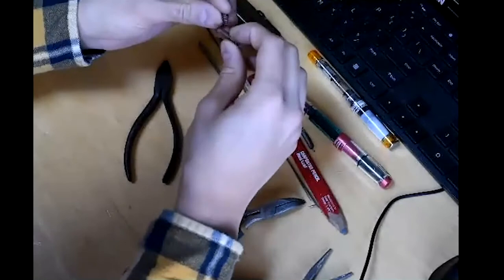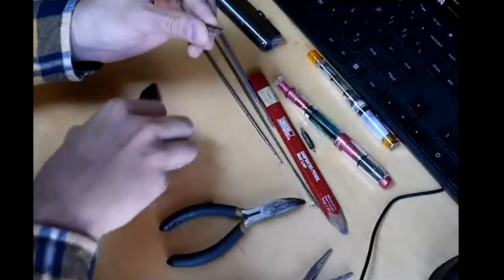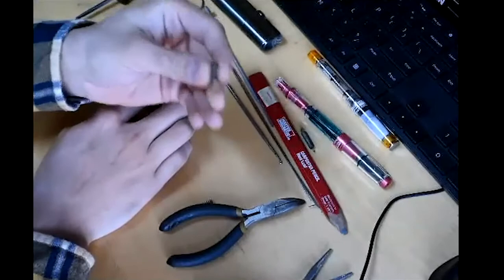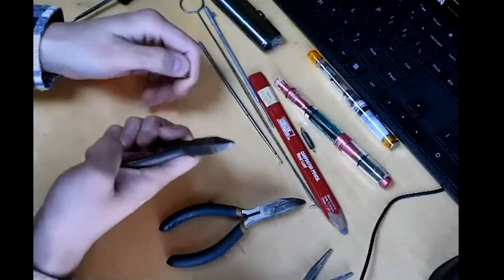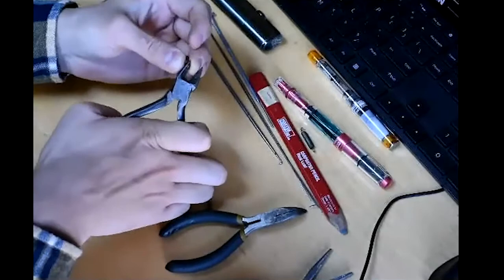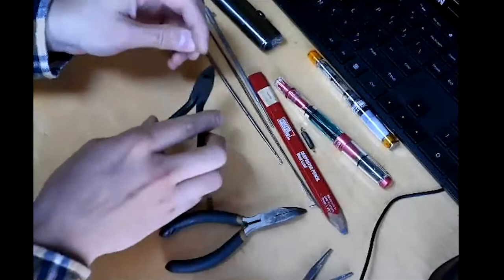There's a trick in the repair books: if a spring has lost its tension and you want to tighten up those coils, take your wire cutters and cut the head off the spring. It sounds sacrilegious, but done right it can help a lot. Then, with the same wire cutters, bend up another loop — stick the edge of the blade underneath the first loop and pry it up to get a second one. It's a multi-purpose tool and very handy to have around.